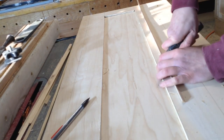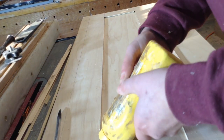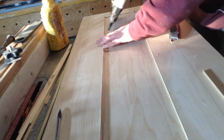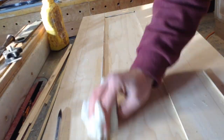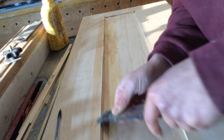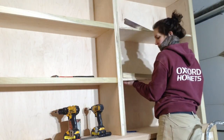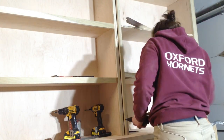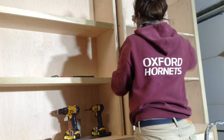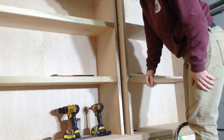There are the little moldings I cut from my cedar. I can go through and frame this out — just 45s in all the corners. It's cedar and it's really thin stock, so I just used a utility knife to cut my corners and tack it into place. This is the beauty of things that are being painted — you can use hardware and whatnot and all of that will be covered with putty. I could shave down the top because it was a little bit proud. Then before I prime this, I went through and permanently attached all of the rails and stiles, except for the two edges — those are going to be scribed to the space, so they need to be detachable.